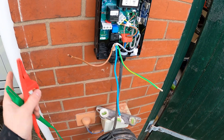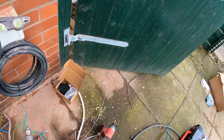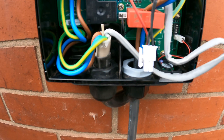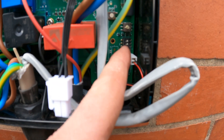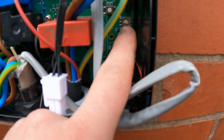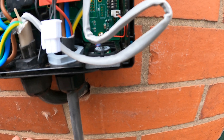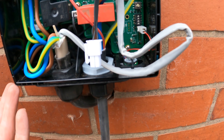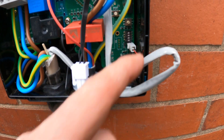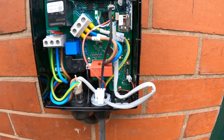Next one: insulation resistance, which I'll go and do at the consumer unit side — I'm not filming that because I'm only filming outside today. But you know how to do it, and if you don't, comment below — I answer every single comment. That's that dead tested complete. I'm just setting these limits now: all four dip switches are set to the right as you're looking at it, which sets this to pull a maximum of 32 amps. But the tiny little dial above it is set to 60 amps, because that's the size of the main fuse in this house. So if the house is using 50 amps, this won't pull 32 — it'll pull 9 or 10. As soon as it's available it'll start using 32 amps, but it'll never go over 60 amps. Until he gets his main fuse upgraded to 100, then he can set that to 80 or 100.